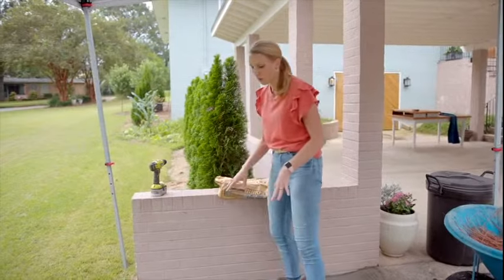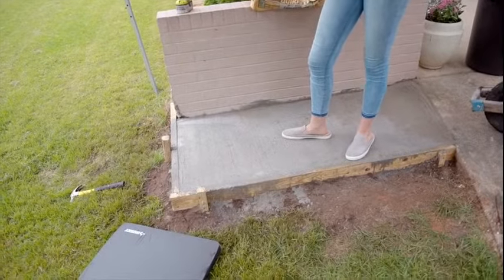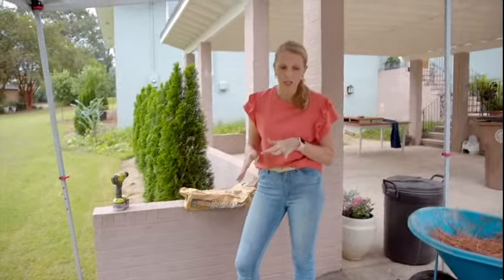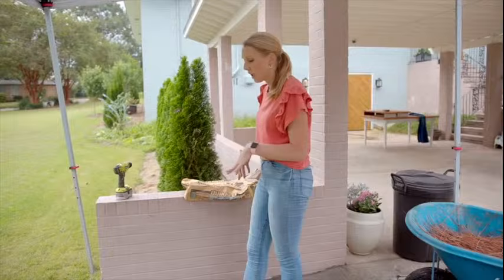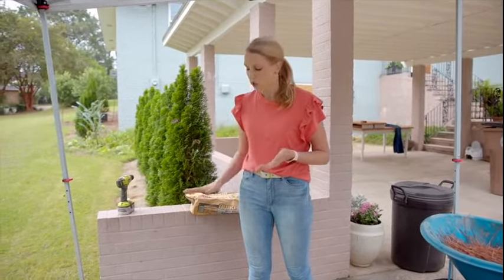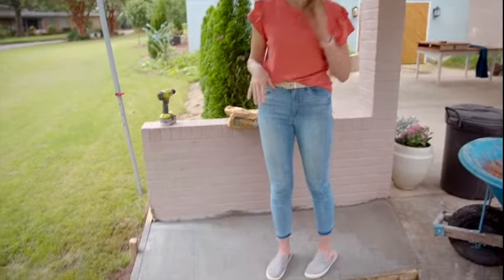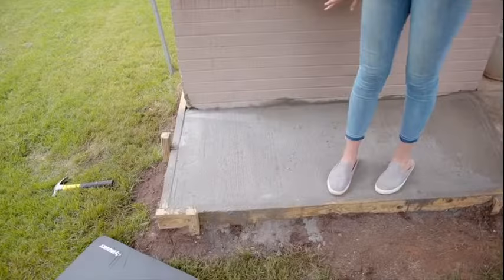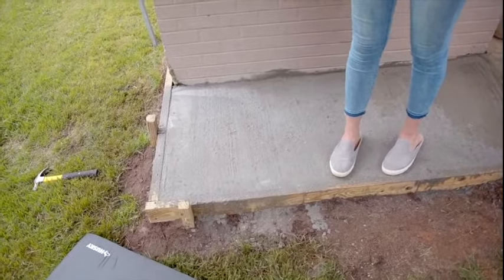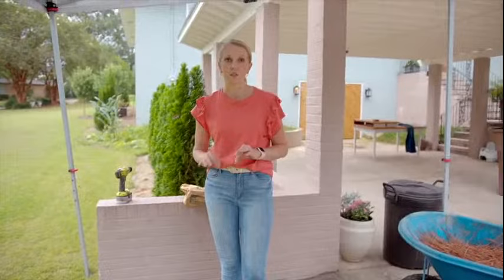Okay, so we have our concrete poured and screeded. Then maybe 20 to 30 minutes after I had it all level, I used a push broom to create a broom finish. That's a little something extra you don't have to do for a garbage can pad, but they do that on patios and porches so that you have more of a non-slip surface.